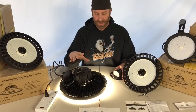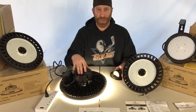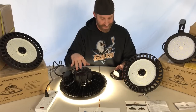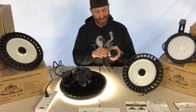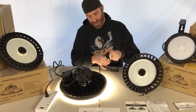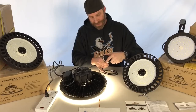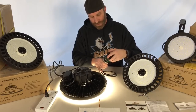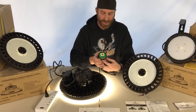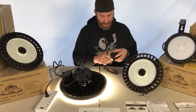Microwave sensors are fantastic. They also have different settings, so you can control how much motion is detected — there are a lot of options. I'm going to show you some of those options now. The motion sensor is built into this light. A small screw comes out and you can open up the sensor. Inside, you can see there are dip switches across the bottom.